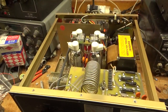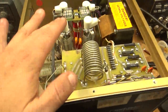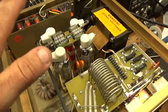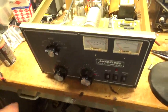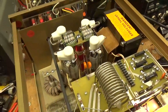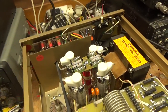The website's AmpRepairGuy.com, 203-892-4119. Without that 200 ohm resistor in there, this thing — about 50-something watts in — gets the full 800 PEP out. Great amp. I won't even work on these if the person doesn't want to put 572s in. The 811s just have so many problems; I don't even touch 811s anymore, or any amp that's going to have the Chinese 811 tube in it.